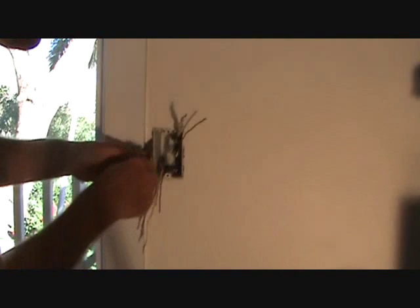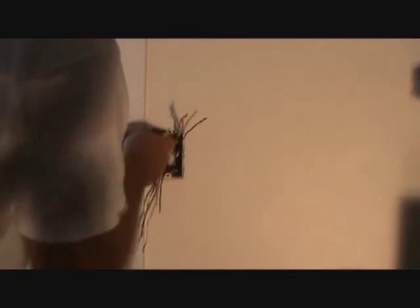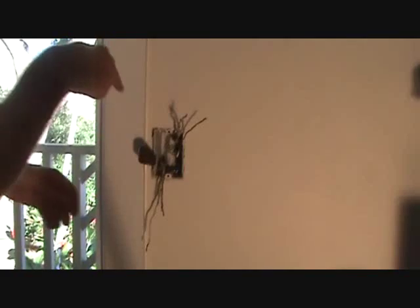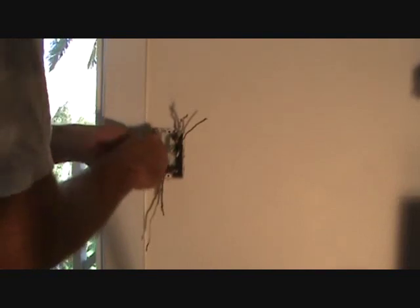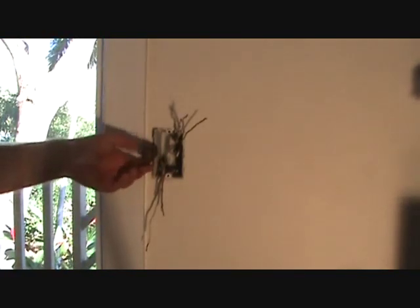I've cleaned up the edge there, putting my putty knife in there. I've got to get up in there. See, there's one nail right there, and there's one down at the bottom — you can kind of see the nail at the bottom going through the box. So we've got to cut those 2 nails. We're going to put a hacksaw in there. I'm going to keep my putty knife in there to allow just a little bit of a gap, and I'll show you what I do next.